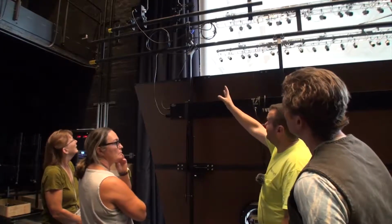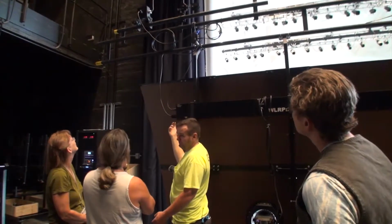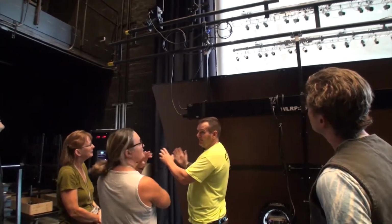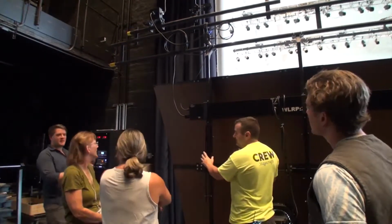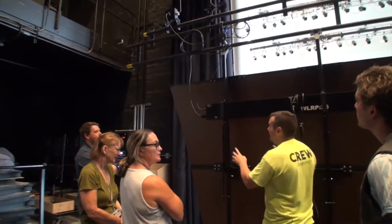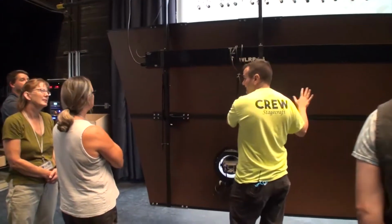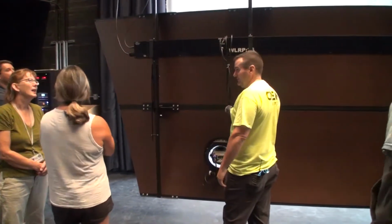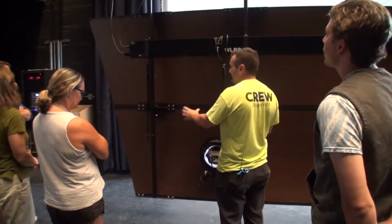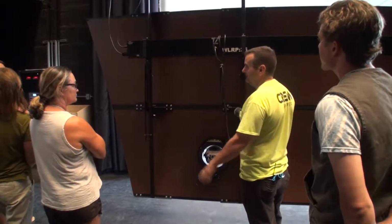So that shouldn't be moved, because right now the location of that box, even though it's just put on with instrument clamps, is plumb. You wouldn't want to put it out of plumb, because it would pull this thing one way or the other. On this side there are no obstructions, but on that side, that railing over there, if these things are swinging left and right at all, you will hit the railing for sure. It's already happened. So just be careful. Nothing should be swinging when you're raising something up. Stop the object, tell people to quit swinging them, and then go on.